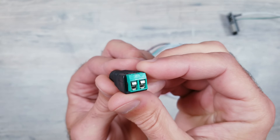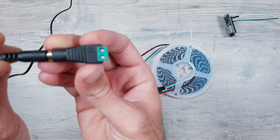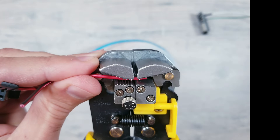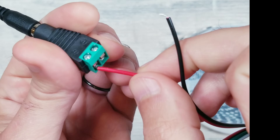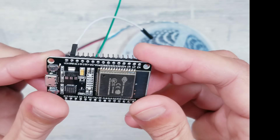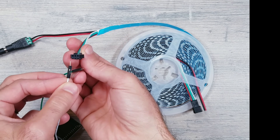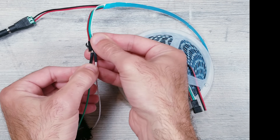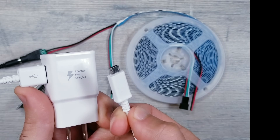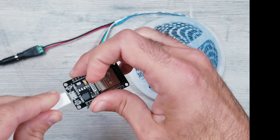On a lot of these power supplies they come with a barrel plug adapter. Connect that to the same 12 volt 3 amp supply from the previous example. At the beginning of the LED strip you'll see a red and black wire — these are your power injection cables. Strip back each wire and put the red into the positive terminal of the barrel plug and the black into the negative slot. Give them a tug to make sure they're in nice and tight. Then take the jumper wire from the GND pin and insert it into the slot of the connector going to the white wire, and the jumper from D2 into the middle slot going to the green cable. Since our ESP module requires 5 volts, I'm just going to use an old micro USB phone charger to provide the power.